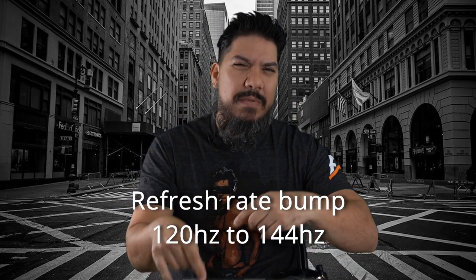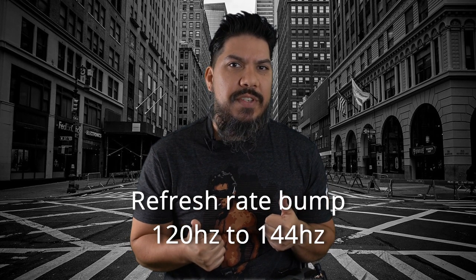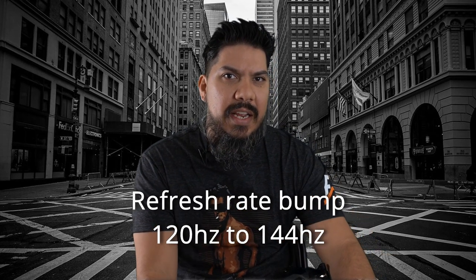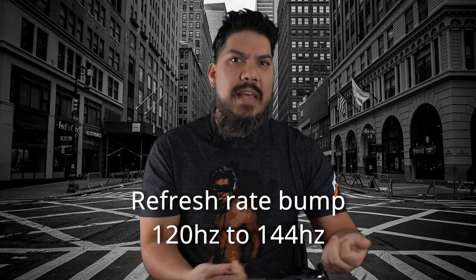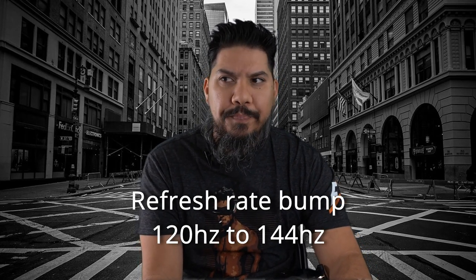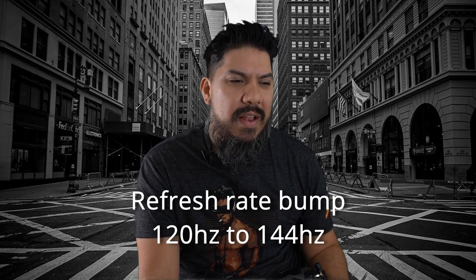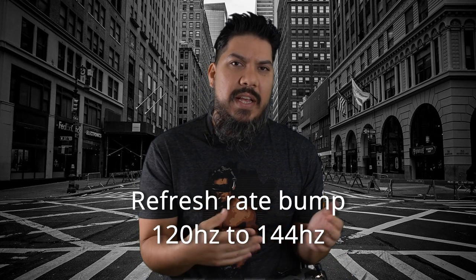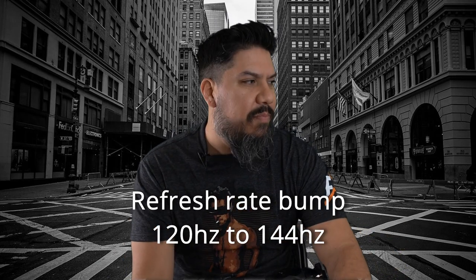Number five: the refresh rate is getting bumped up to 144Hz. Now if it was previously 60Hz that would be huge, but it wasn't — it was previously 120Hz. Refresh rate being boosted is always super welcome. Back in simulator when I used to play Velocidrone and start competing, I had a 60Hz monitor on my laptop, then I bought a big screen at 144Hz and doubling that refresh rate was huge — latency seemed to disappear, like flying Crossfire for the first time. But 120 to 144Hz — is that even going to be perceptible by most people? Not really. People are also saying the original Vista and Air Unit are only capable of outputting 120Hz video, so this probably won't be a big deal.